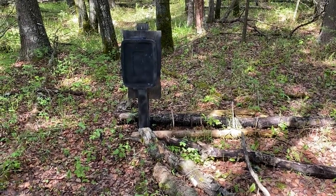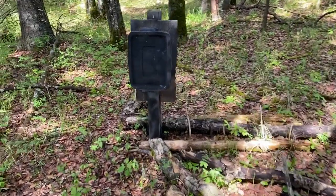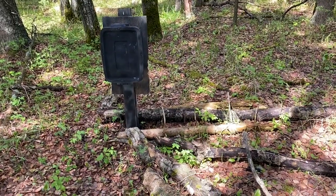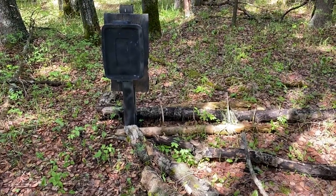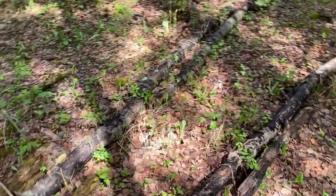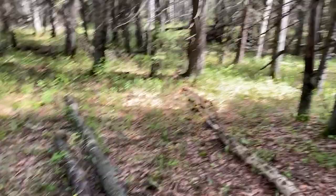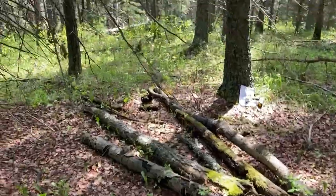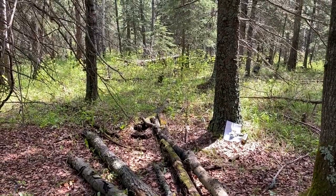This happens to be my west box. As I mentioned, from each box I'll have four wires selected — in this case I have two single wires and two broadside pairs. What I've found over the years works best for deploying the coax to the individual wires is not to just lay the wires directly on the ground exposed — critters will come and eat them and I've had a few bitten wires. What I've done, which I found to be a lot easier, is to clear a spot and then on top of the coax I'll just lay deadfall. I'll find a bunch of long trees and just lay them on top of the coax. It provides protection, prevents animals from eating the wire, and it's actually pretty easy to deploy and set up in the field.